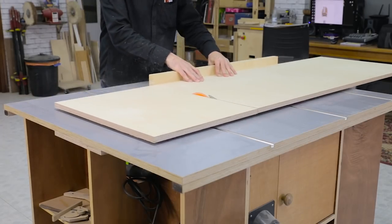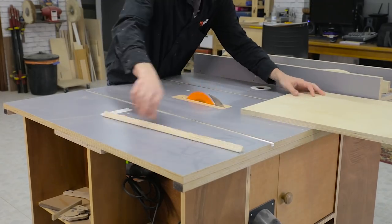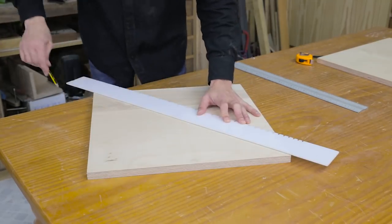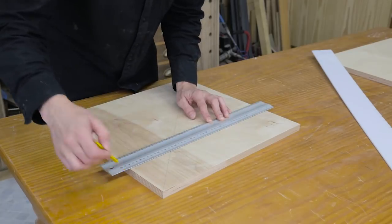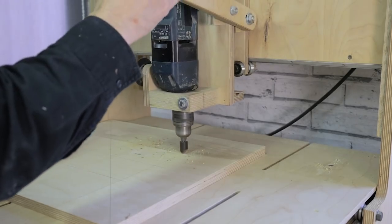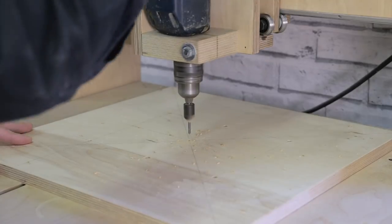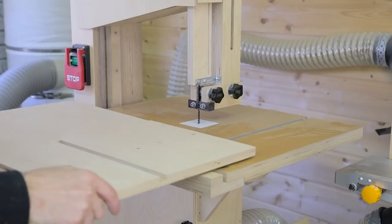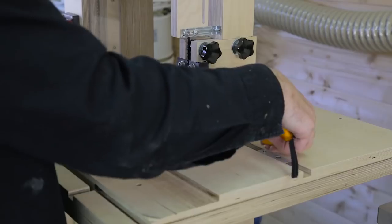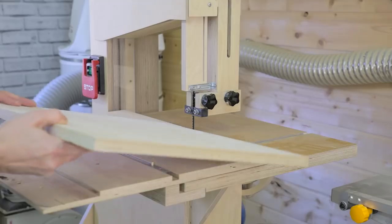Now I'll show you how I built it. With a table saw, I cut the two pieces that make up the bottom of the stand. Now I mark the diagonals to find the center of the piece, as well as the position of all of the screws. I drill holes with the screws using a countersink bit, and also drill the center of the piece. This hole will allow me to rotate the piece on an axis in the bandsaw and cut the two round bottom pieces. I work out the radius of the circle by measuring it from the saw blade to the rotation axis, and cut the pieces little by little.